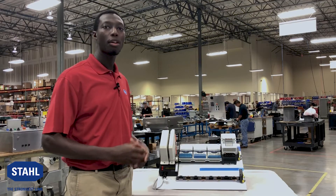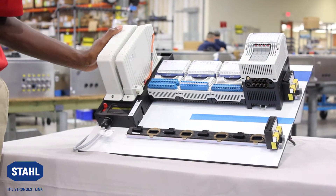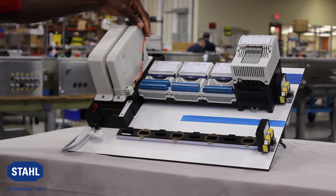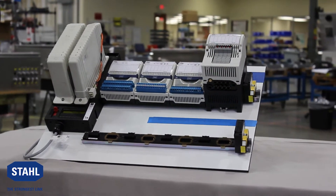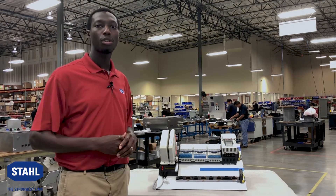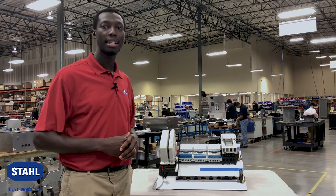The main challenge is our power supply. We fit our power supply through the conduit and it lands on our base. The power supply, the base, and the CPU — also known as our communication module — are considered explosion-proof devices. The Remote I.O. system is considered intrinsically safe at this point.